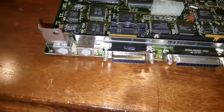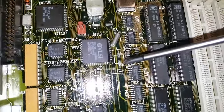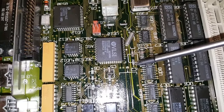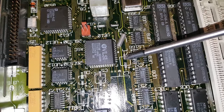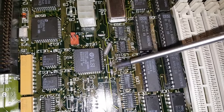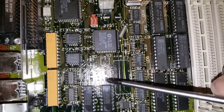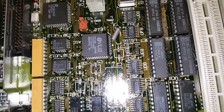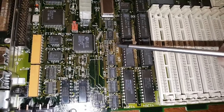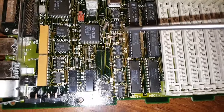When cleaning these pads you can see where some copper is gone — be very careful, because the capacitor electrolyte has sat and corroded so long that pads want to come off. One just let loose on me, which is an unfortunate side effect of letting these sit too long. This probably won't be the only one. I can't emphasize enough: if you do the dishwasher trick and leave it alone without recapping right away, this is what you're going to end up with.